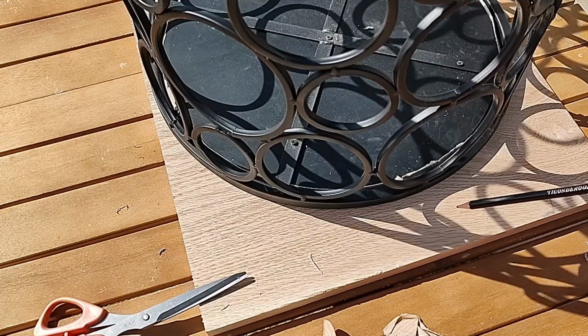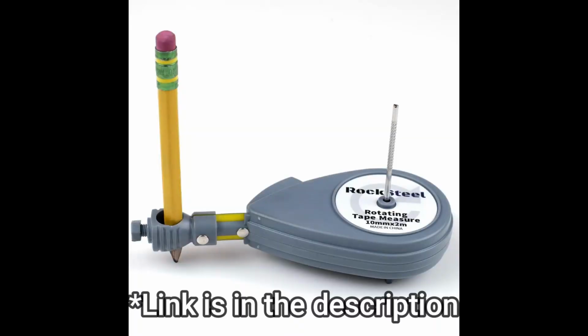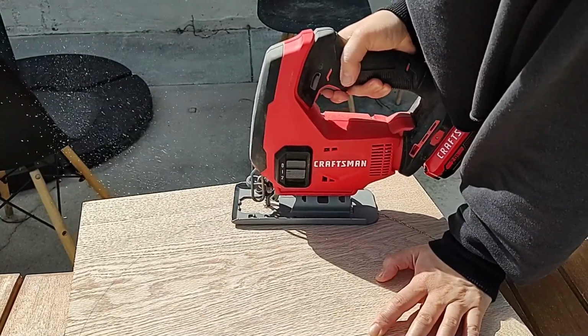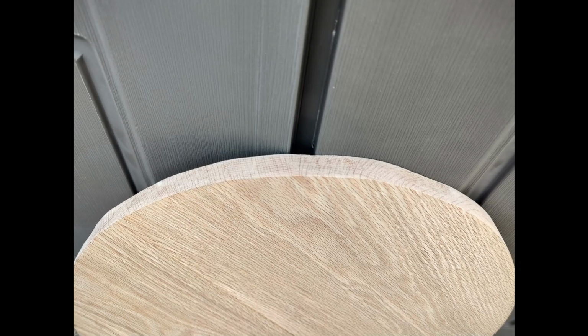The diameter is the same as this side table I had, so I drew the circle using it. You could use this tool to draw a circle. The link is in the description. And here are the 4 methods that I tried to cut a circle shape. I first didn't have a router, so I tried a jigsaw, and it became a complete disaster. It became so wavy and looked like an amoeba or something. Wavy furniture is a trend, but it didn't even look like that. Maybe because red oak is too hard for a jigsaw.